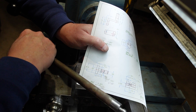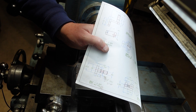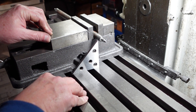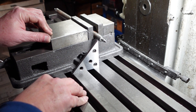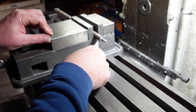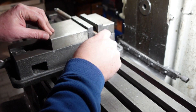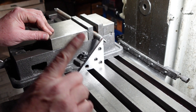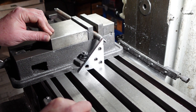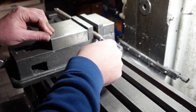I'm now going to take this to the mill and square that up. I've done both ends of the rod and once I've done that I'll part them off and hopefully have my trick bolts. To put the squares on there are several ways: you could use a dividing head, or a square collet block, or a hexagonal one with an adapter. The simplest way is probably just to run the cutter across, take that down to where it needs to be, then turn it 90 degrees and square it up. Two of the parallel sides are critical; the other two aren't quite as much. You basically want a 6 millimeter square section.